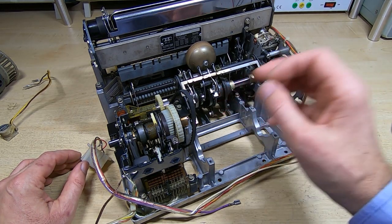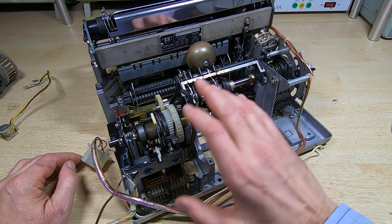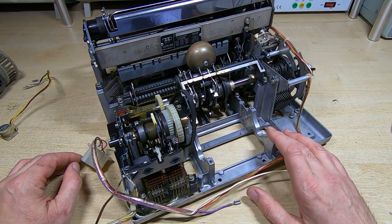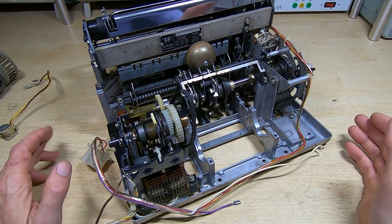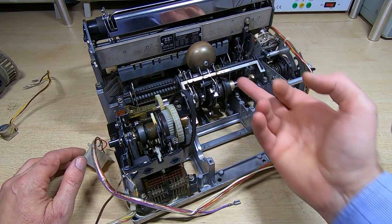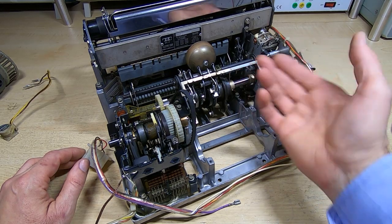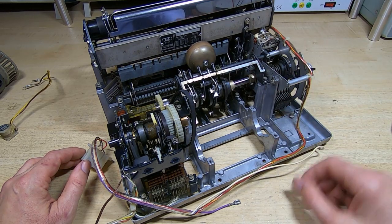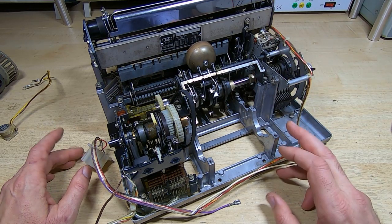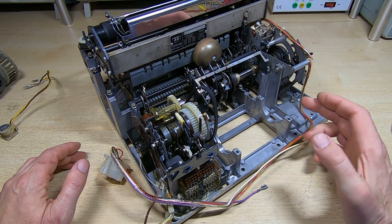It will strip it off, and when you first take it out, it'll look fantastic. The next morning it will be a mass of rust. So water's fine as long as you dry it off as quickly as possible. You can elevate the temperature, use a hot air gun, but again, with devices like this that are a mixture of large castings and small components, you're probably just going to overheat a small component or plastic or bush, and you'll probably damage it.